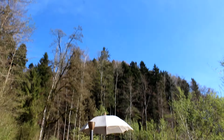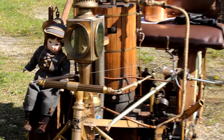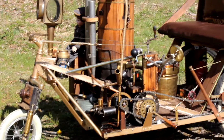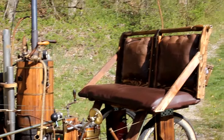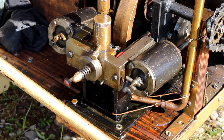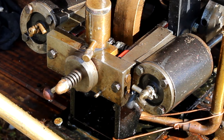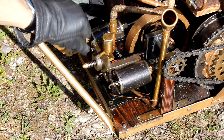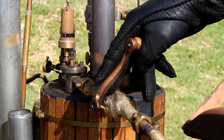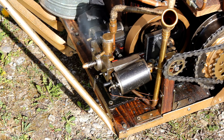But there's one thing you should know. The last time the engine cooled down, a small amount of steam condensed into the cylinders and some pipes. As you may know, water — unlike steam — is not able to compress. So if we just moved the pistons now, the cold water could cause huge damage to the cylinders. For this case we have valves on the cylinders that you can open to blow off the water. We gently open the main steam valve until we can watch the old water blowing off.